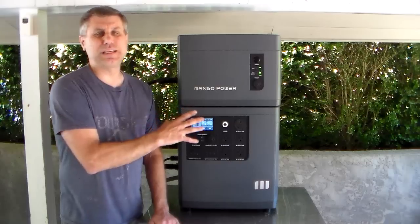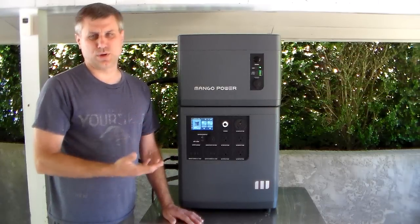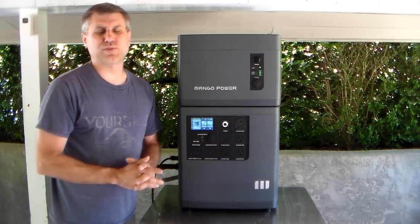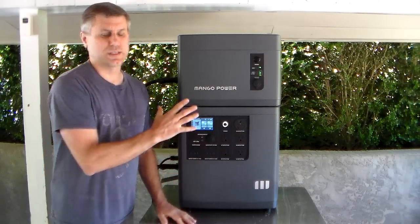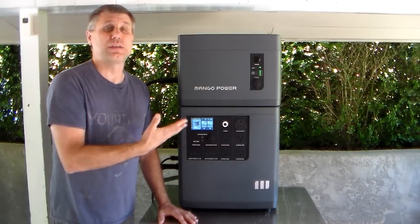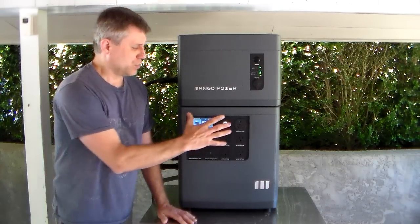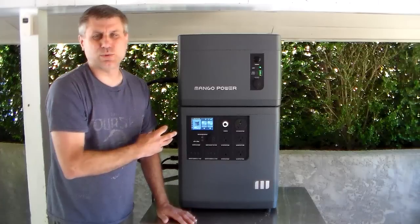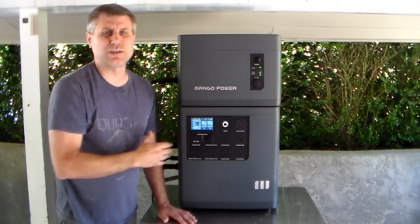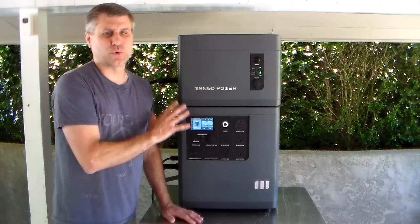You can purchase another bottom unit, buy the box, and attach the two bottom units to make 220 volts. So you could power some other things — you could power a dryer, which I don't recommend — but probably the biggest thing people want to do is power their well. It's 240, split phase. You need two units so your cost is very, very high. If you need to do that, you might look at having a professional come out. But if you can't because you're renting or it's not feasible, you can combine two lower boxes, connect with a special box they sell, and have your 240. If you want the 240, you can add a battery box on each one and you've gone up to 14 kilowatts — that's a lot of power. This would definitely be for a tiny home or an RV.